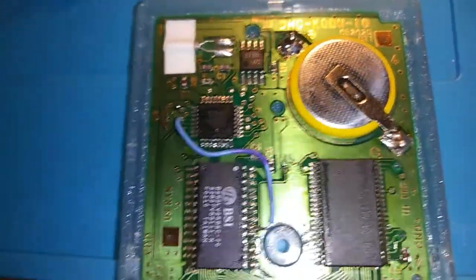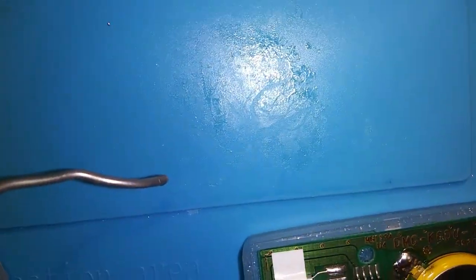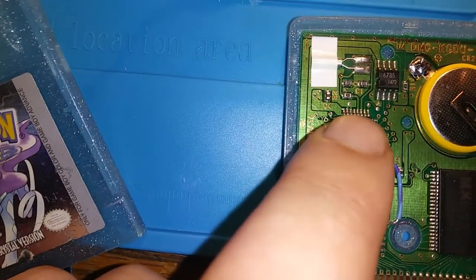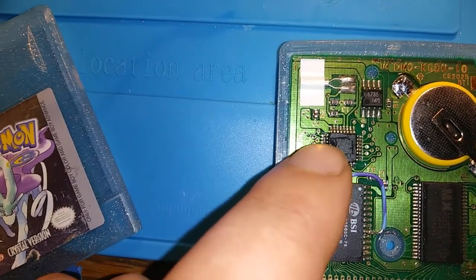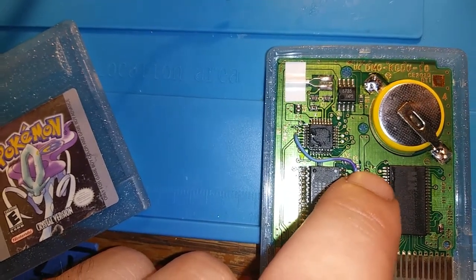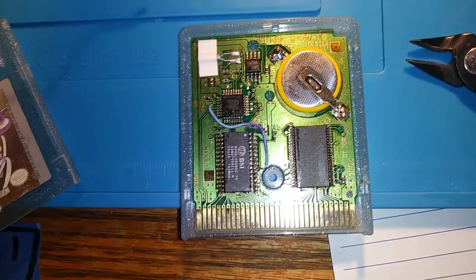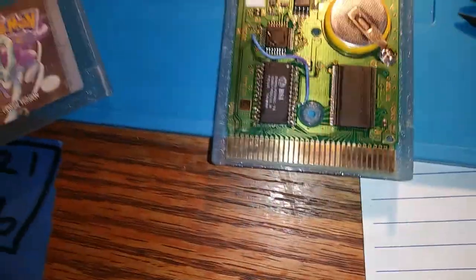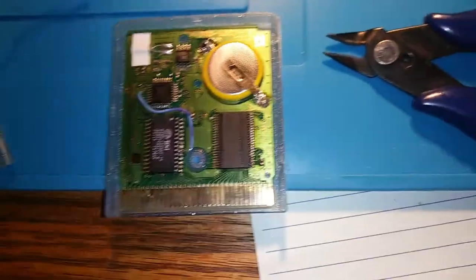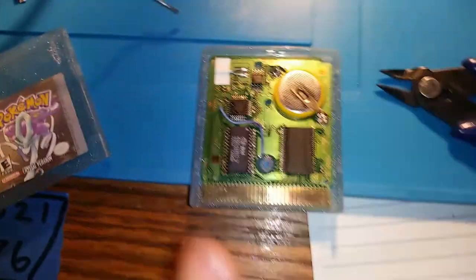It ended up being the trace between the third pin on the left here and the ninth pin here — pin three and pin nine — via this trace on the backside. It's kind of right in the center of the cartridge; I guess that's where it gets the most rub or something like that. It just so happened that trace was deteriorating even more as I was cleaning it the first time, that's why it got worse. But sure enough, just replacing that trace with a bodge wire fixed it. So that's a big thumbs up.